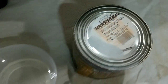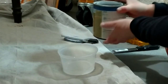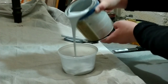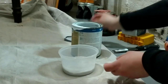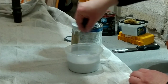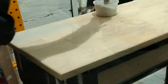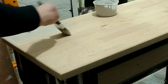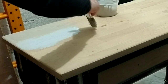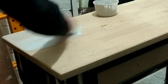For the tabletop, I wanted to do a couple of different colors with color washing, which is just diluting the paint a little with water. So I started out here with the same light gray paint that I used on the body of the table, mixed it with some water. Make sure you stir it really well so it's combined thoroughly. Then you basically apply it the same way you would apply stain.